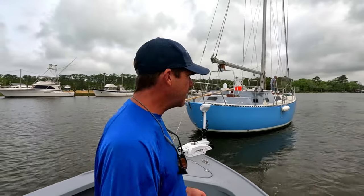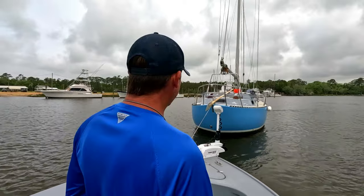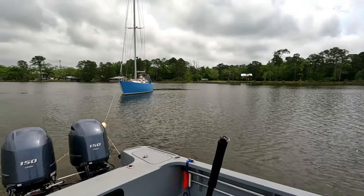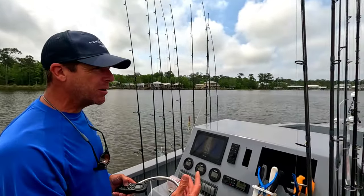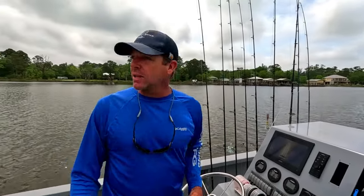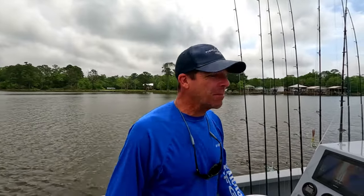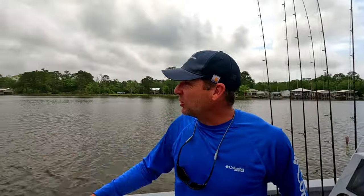I'm finding that the trolling motor on the bow does a great job of controlling the boat. If you've got a bow-mount trolling motor and you're trying to pull somebody, deploy that trolling motor and use it like a bow thruster to steer the bow around — it allows precise movement, super easy. We've got our bridles hooked up to the back that Mark custom made and we are underway. The trolling motor on the bow works amazingly well. Sometimes when you're towing a big boat with a small boat the big boat ends up pulling you around, but I'm able to keep the bow pointed where I want. We're going super easy, not a lot of power, just making sure it does what we want.